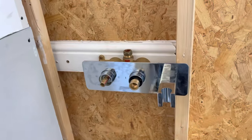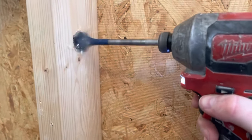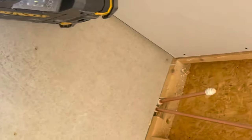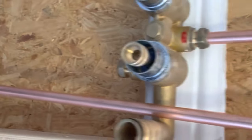This is what the valve kind of looks like set up. We've levelled it off, made sure the levels are in. This is for the clips. We're going to drill our mix feed up which is going to go up to the shower head. There are our pipes coming through — we're just going to make sure to clip them, level them off, make it look nice and neat.